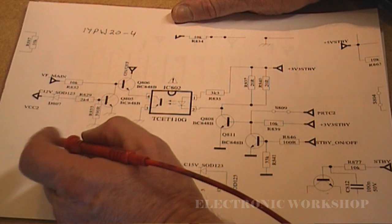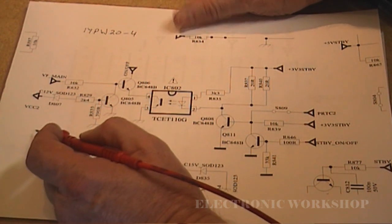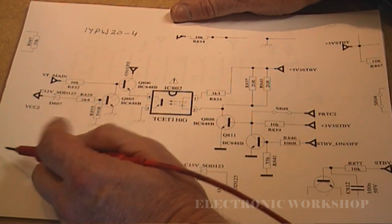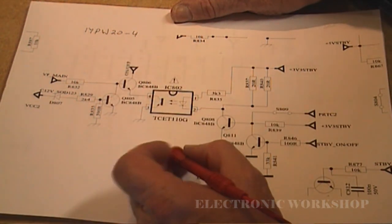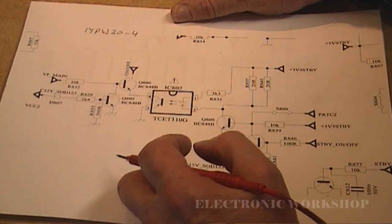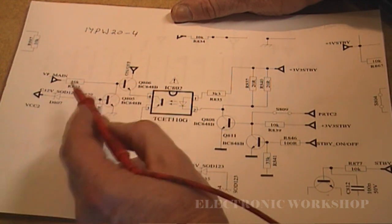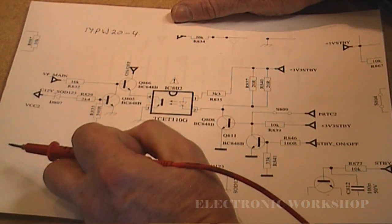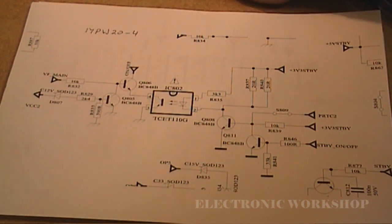I don't know exactly what it is, but all I did was get one out of another Vestel power supply I had here and stuck it in its place. By heating around this area and using freezer spray, that's the only way I narrowed it down to this small section. Up to that point I was totally in the wrong area and had replaced a lot of parts — lucky enough I had a lot of old scrap boards.